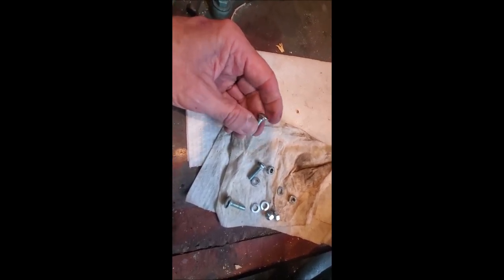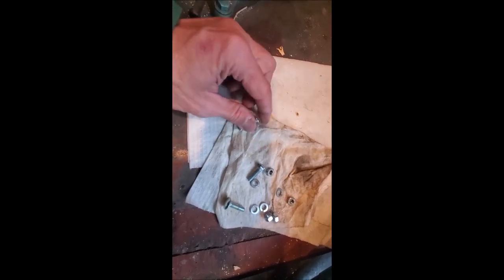But for a little stubborn that I am, I decided to put the bolt in my vise, and with my handy dandy 20-plus-year-old, I think this is a Makita grinder, if you just touch up the surface, both here on the flat that's going to go through the rectangular slot, and then 180 degrees out the other side. If you just scuff this up slightly, and then just scuff across the top of your threads, just on one side, not all the way around.